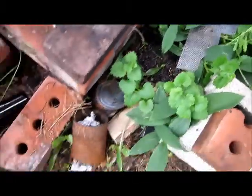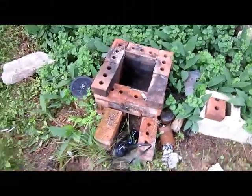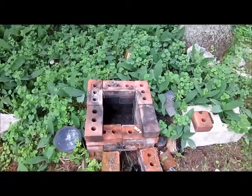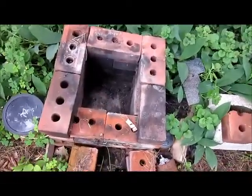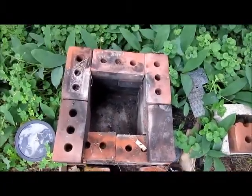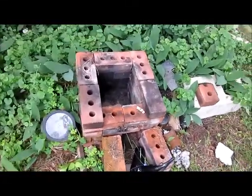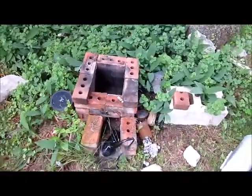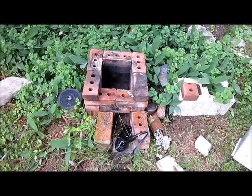That's just a pile of dirt, and this is all the scrap aluminum. So yeah, that's how to build that forge. I should have another video on melting metal very soon, either this weekend or next weekend. Subscribe, whatever you want to do — it helps. This forge, in pristine conditions, you can probably get it up to well over 1,000 degrees Celsius — well enough to melt aluminum. Maybe if you got it good enough, you could probably melt copper, but you'd need a better crucible. For my crucible I use a propane can — those green lantern or stove propane cans work really well. You just grind off the top, make sure they're empty first of course. Also, I have to say I'm not responsible if you do this and you mess up. Good luck.